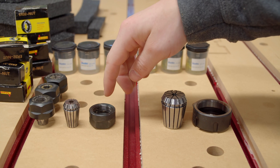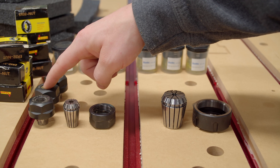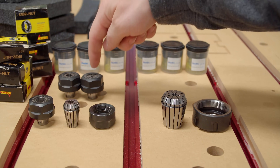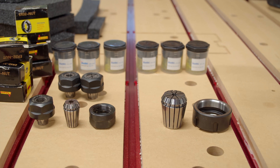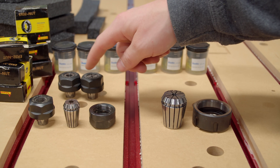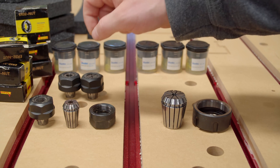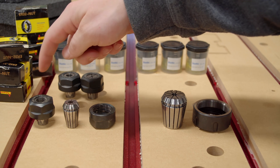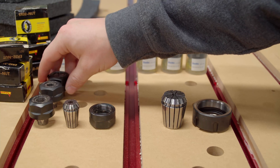With my current old setup, I had a 1/8-inch collet, quarter-inch collet, 3/8-inch collet, and 1/2-inch collet. Truth be told, I don't think I've ever used the 1/8 or 3/8-inch collets directly, because most manufacturers step bit shanks down to common sizes. I've run a 1/8-inch bit, but it had a 1/4-inch shank. Same with 3/8 — I've cut 3/8-inch wide with cutting edges on a 1/2-inch shank. So I've never actually used those two collet and collet nut combinations.